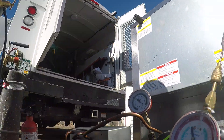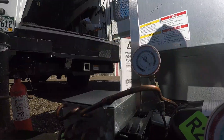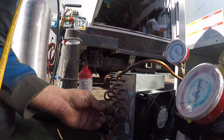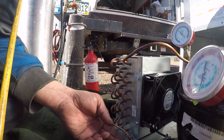Hey YouTube, this is George with Cherry Creek Refrigeration. I'm talking to you today about finding a leak in a cabinet. Sometimes you can go through the whole cabinet, soap bubble everything, and never find the leak because it could be inside the coil. This is R290, and these coils have gotten real thin and real small.